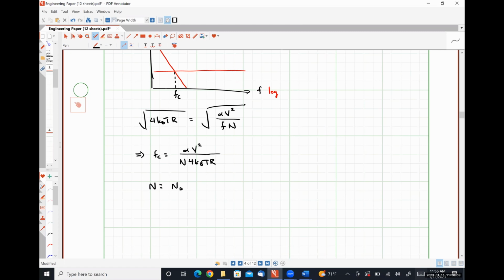So N, if we're dealing with silicon here, and let's just make that assumption because we've been dealing with silicon the whole time, right? Silicon has an intrinsic carrier concentration somewhere in the ballpark of 10 to the 10 electron hole pairs per cubic centimeter. Since our dopant concentration is 10 to the 16, I would argue that this is a very N-type section of crystal, and so we can neglect our hole concentration without losing any real information. Yeah. So let's just deal with the ND, right?